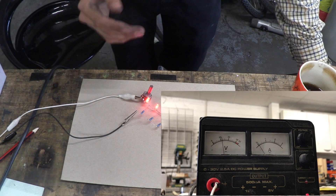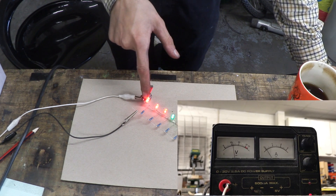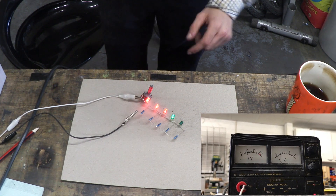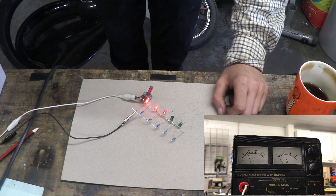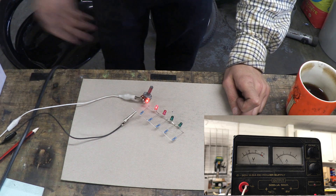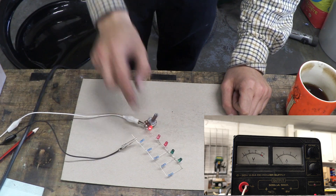Now that this is calibrated at 12 volts, whenever it drops below that, the LEDs are going to start getting less lit all the way down to the bottom, which I think is somewhere around 3.7 volts. So we can pretend that our power supply is a battery — let's say it's somewhere around 10 volts. We drop that down to 10 volts and the end LED turns off. Let's drop that down to 7 volts — the three red ones are only lit now, indicating the battery is low. If we drop that down to 5, you're going to see the last two lit up. And then if we drop that down to 3, you're going to see the very last LED lit up. Now we know that works, I'm going to pretty it up by making a little case out of 1mm thick acrylic.